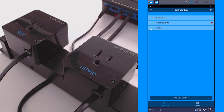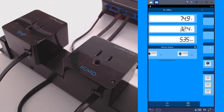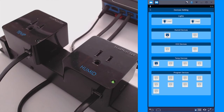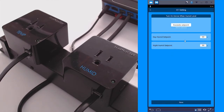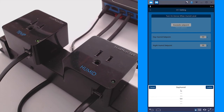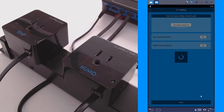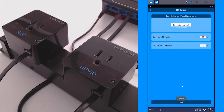Now let's look at the programming on the phone app. I'm going to open up SFOffice, click on that gearbox to open the device settings, click on H1 for the dehumidifier. Exceed setpoint is going to be dehumidify. Click on the dehumid setpoint, dial that into 65, press confirm, and then press save to hold that setting. You'll see 'success' right there, meaning that the device has been programmed.